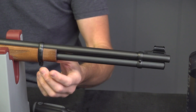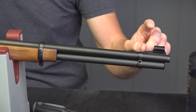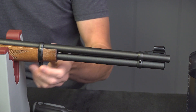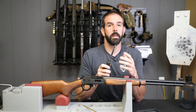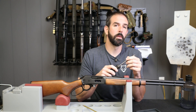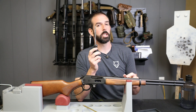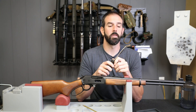First up we're going to have to remove the screws for both barrel bands, the front sight hood, the front sight, and the hand guard. As always you want to have a good set of hollow-ground screwdrivers when you're doing this. If you don't have a set, tape up the end of your bits so that if you slip out you have less chance of marring up your finish. Also make sure you use the right size bit — these screws are temperamental and you can break the heads on them fairly easily.